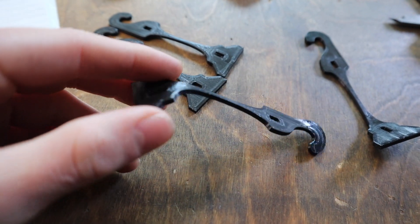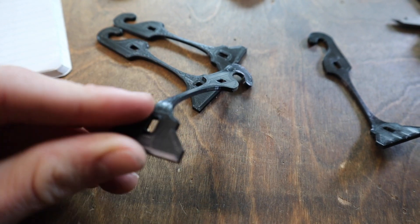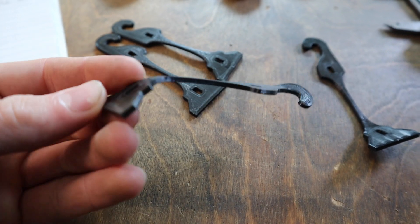Creep is plastic deformation at stress levels significantly lower than the yield point of the material. Places you might see this are pins under spring pressure — even with bushings in some cases — those pins or bushings can actually flow in the plastic and your holes will get egg shaped. That is a result of creep.